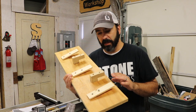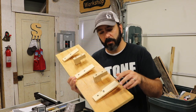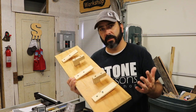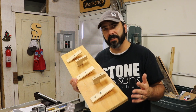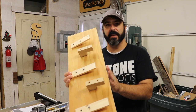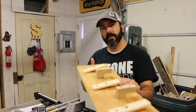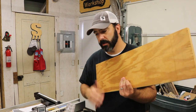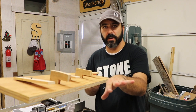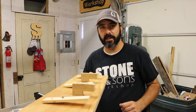The beauty of this jig is that being a piece of scrap wood, you can move these things around — all this stuff is held down by screws. You can move them around depending on the size of your piece that needs to be tapered, move them closer to the edge. You don't want anything hanging off past the edge, because this is what rides on the fence. You don't need any runners for your table saw — it just rides right up against the fence, and whatever is hanging off here gets cut off.